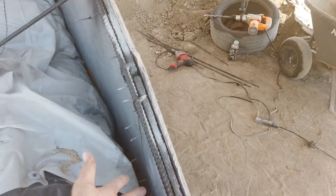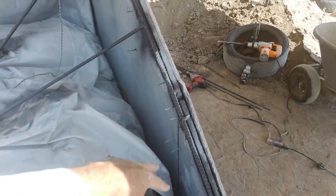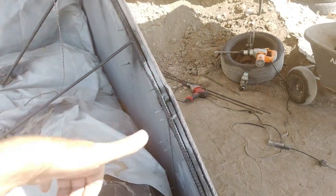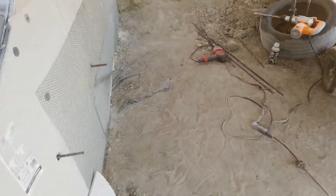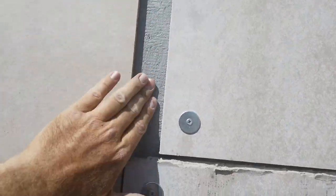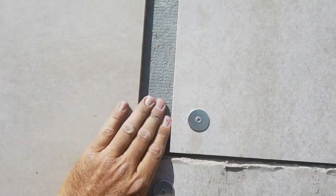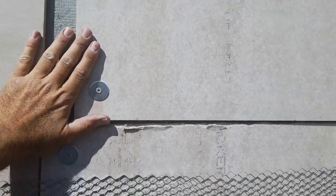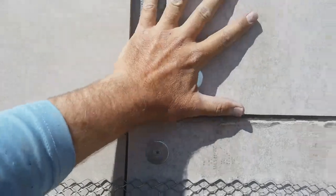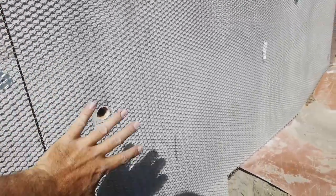I made a triangle frame with close-to-half-inch OSB and screwed it together with braces using six and eight inch long drywall or decking screws into the tire bales. Then we coated the whole thing on all sides with garage floor paint and put metal lath over it. There's a little bit of a gap here but I'm not too worried about that. The metal lath won't help with strength, but the concrete plaster on the outside will.